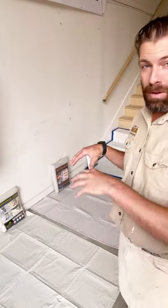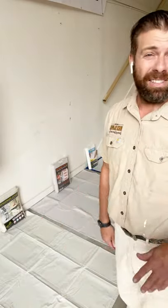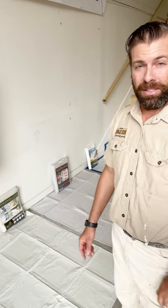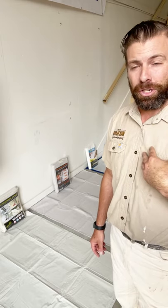In the past we've cobbled together all sorts of Frankenstein solutions, even making wood platforms clamped to the end of decks with a bar for ladder feet. It's not as safe. The easiest, safest way is to take an anti-slip drop cloth, lay it over the top, put step ladders or extension ladders over it, and test it. Not only is it super safe for your people, it actually protects the decking really well. I don't hear enough about this: anti-slip drop cloths provide just as much floor protection as protection for your people.